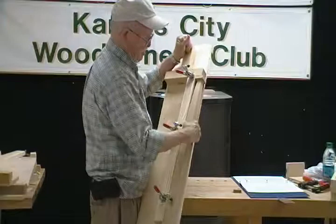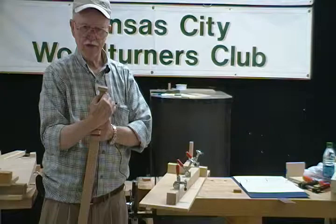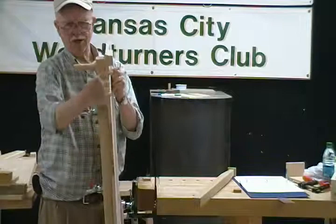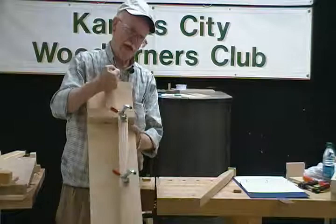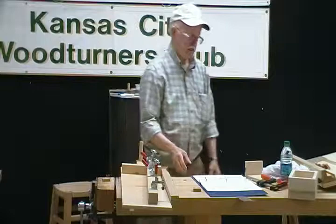You put this in the jig, establish that angle, and when you saw down it saws this taper out, all the way down to right here. We talked about stops — why would you want a stop there? You don't want to cut off the end. It's very easy to cut off the end. On the sled there's a stop right there; when it gets to the saw table it stops right there. This is a band saw taper jig — you can make a taper jig for either the table saw or the band saw.